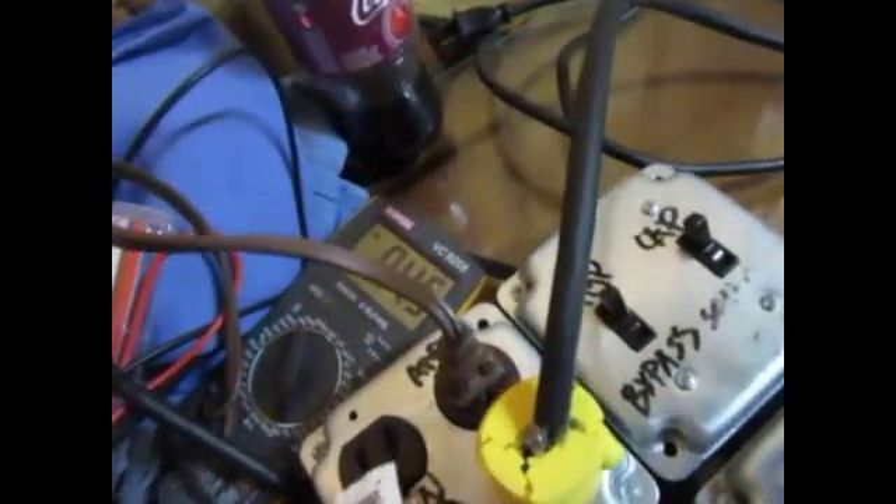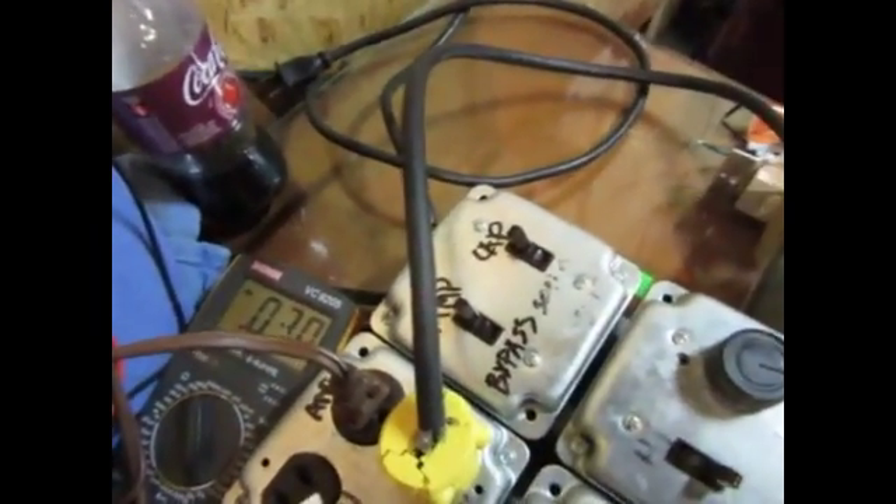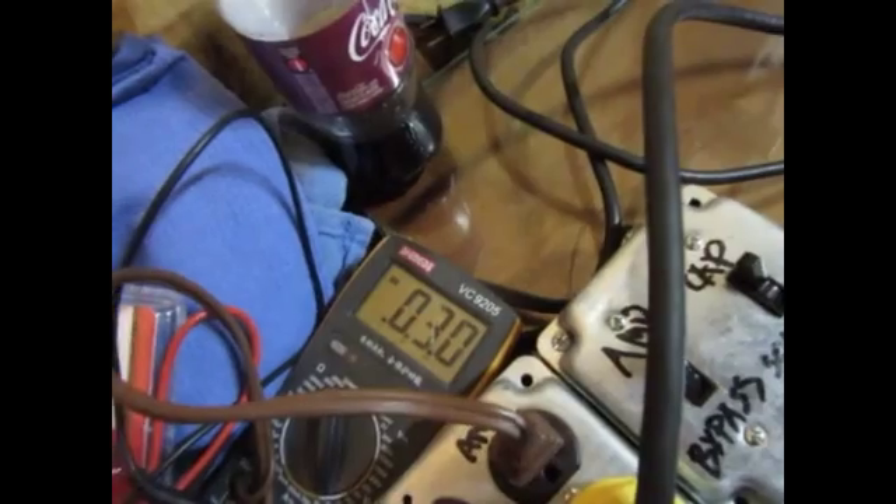Now I'm going to go back to high-medium. That's steadied out at 0.3A — so it's already towards high, but that's what I want: something that's under high. Turn it back up to high — quite a difference. I think we finally have a winner with this transformer-based FASCO 4-speed control that I got with my FASCO Charleston.